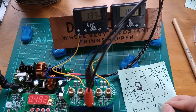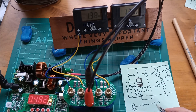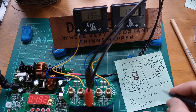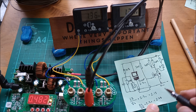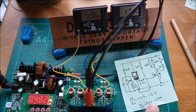That calculation gives 2.13 volts — and the problem is that's not 2.2 volts. So we'd actually need a higher voltage across the capacitor to get 2.2 volts at the potential divider midpoint. Working backwards: 8k6 over 6k8 times 2.2 volts equals 2.78 volts. So the capacitor has to reach nearly 2.8 volts to put 2.2 volts on the LN61C voltage detector chip.